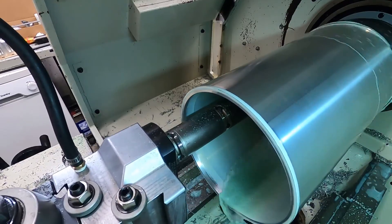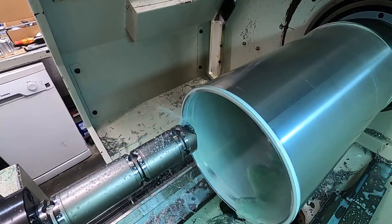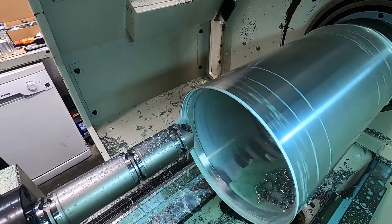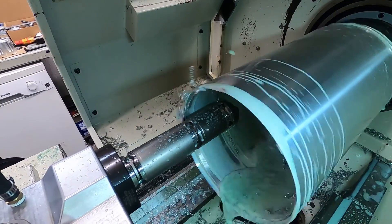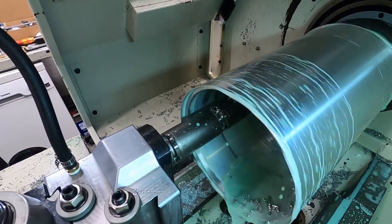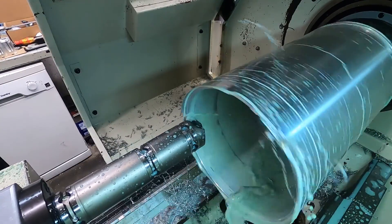You can just loosen that screw on the main holder — it's just like a half turn one way or the other to loosen and tighten. On the adapters you do have to screw it a little bit more to tighten it down and unscrew it. But you just undo that, put in your new tool, tighten it back down, and go back to machining. So instead of changing the tool on and off the Aloris post, you can just use this modular setup to go from one tool to the other.